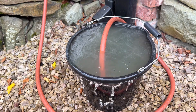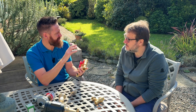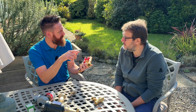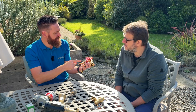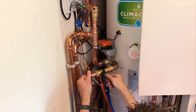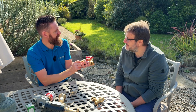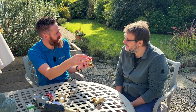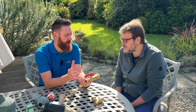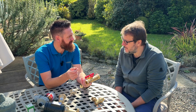If you fit this on the return before the heat pump — a lot of people don't like flushing heat pumps through, they do a bypass and flush that way — with these you don't have to. If you've got this on the return side to the heat pump and you're only putting mains cold water in here with the dirt coming out the other way, you're never going to get any mains dirt through the heat pump itself. It's a really clever way for guys doing heat pump installations — if you've got half decent mains pressure, fit one of these.